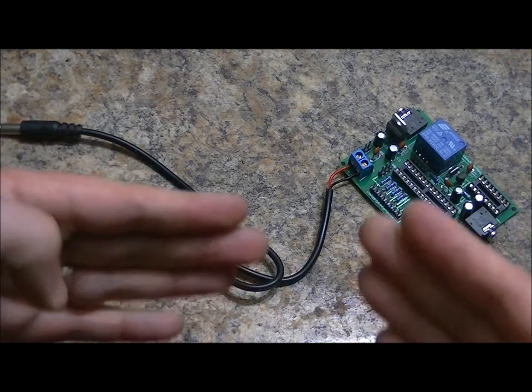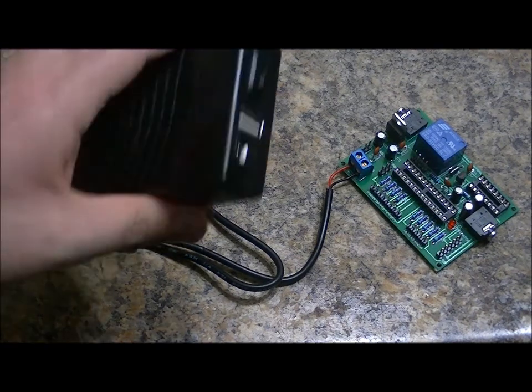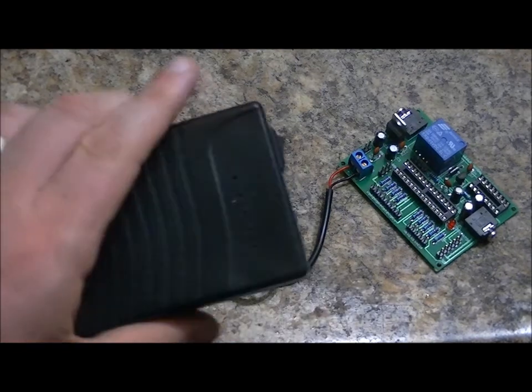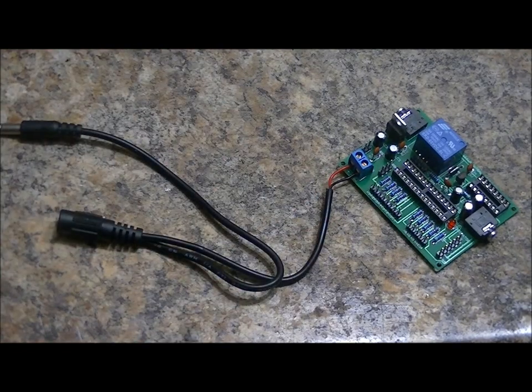because essentially you're short-circuiting the entire battery, which means that all of the current will go from the positive to the negative, and I'm not sure what kind of internal heating or internal circuitry this has. At the very least, if it has an internal fuse, you'll damage that, and it'll be rendered useless. So, do everything offline without this connected.